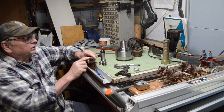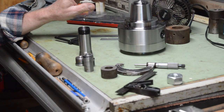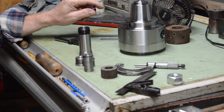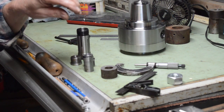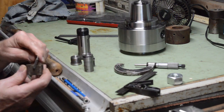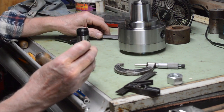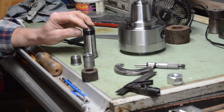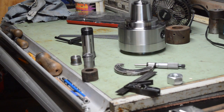The 5C specs say the D dimension is the internal thread: 1 inch 042 by 24 right-hand thread, which is what these are. This stock is inch and a half, so I need to take about a half inch off the OD, put a thread on it - I don't really need a whole lot of thread. I won't do that tonight; I'll probably start on that in the morning.